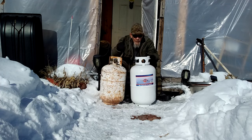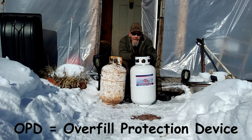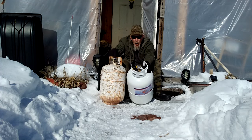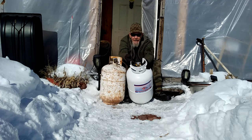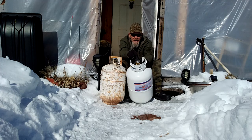I took the tank down to the propane guy and said, 'What's wrong - is this valve messed up?' He said, 'No,' and here's the number one tip: these valves are not like the old ones where you want to crank them hard open or hard shut, and you don't want to open them up too fast. These valves on modern tanks are called an OPD, which stands for Overfill Protection Device. All new tanks have OPD valves, and if you have older tanks with older valves, most propane places won't fill them unless they have the OPD valve installed.